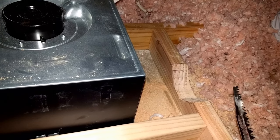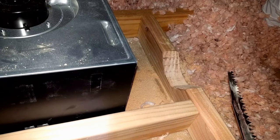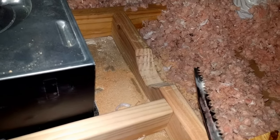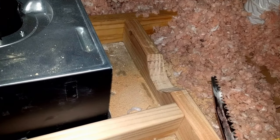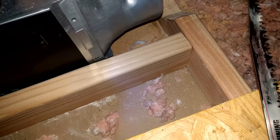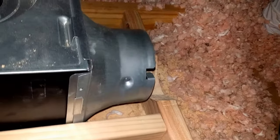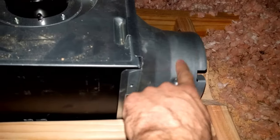After much careful cutting, I finally hollowed out that 2x4. There's still about 2 inches left and I'm not terribly worried about its integrity — it's not holding a ton of weight, so I think it'll be fine. I ended up using a reciprocating saw with a blade — I think it's called the Ugly Stick. I'll try to put a link in the video description. Clearance-wise it looks like I'm going to be fine, even with the adapter. The adapter is still a little bit loose, so I'm going to crimp it slightly with an HVAC crimper. I'll also try to link to that tool in the description.